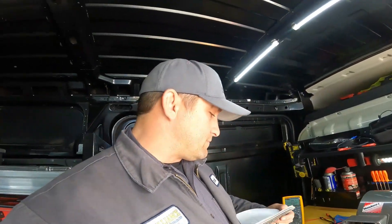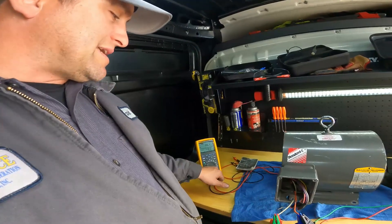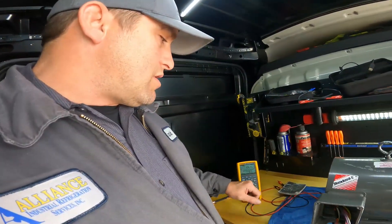When I get a bigger motor that has a similar issue, I'll show you guys why I originally bought this milliohm meter — because on some bigger motors, the resistance is so low that regular meters can't pick it up. This Fluke meter does have a low ohm value setting, so it was able to read out three extra digits after the decimal point. You need those extra digits to be able to compare and make sure you're within that three percent. Thanks for tuning in — make sure you like and subscribe and I'll see you on the next one.